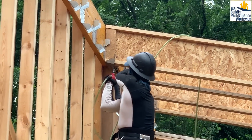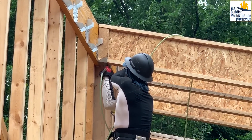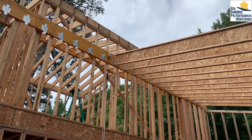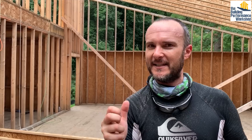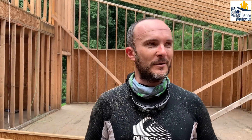So now I'm trying to push as much as you can. We've got about a dozen rafters in at this point, which I'm very happy about. They're all working out within about an eighth of an inch. I had to play around with the clips a little bit — when you start nailing in, sometimes if you start in the wrong place, it'll push the piece of wood further away from what you're trying to fasten it to. So I had to learn over the first couple, but I was confident. There's always a little bit of technique with this stuff — tools are cool, but if you don't have technique, you don't have anything.